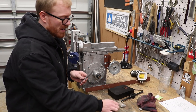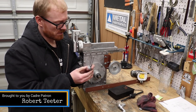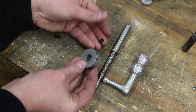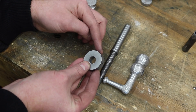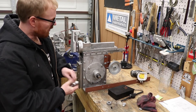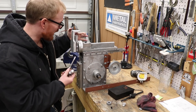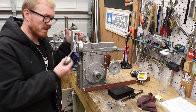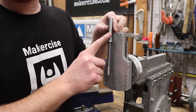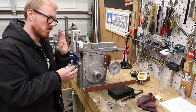I cast these extra parts along with the downfeed — the idea was that this would serve as a graduated disc and a pointer that would go at the top. Because what I had on hand was a half-inch ball crank, I went ahead and turned this to half-inch instead of three-eighths of an inch like in the book. So what I'm going to do instead is use one of these graduated discs that I have on hand — thanks Bob — and I'm going to have to open it up a little bit because it's 12 millimeters in diameter and this is a half-inch shaft. I will drill this for a set screw, drill the ball crank for a set screw, and then mount it all up. I'll need to drill holes in the downfeed as well as a hole in the top of the rotating head, tap that hole, and shorten up this downfeed screw on both ends. I'll grind it flat for the set screws to bear against and then I should be done with the downfeed.